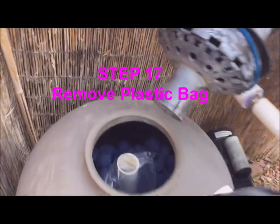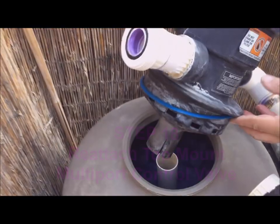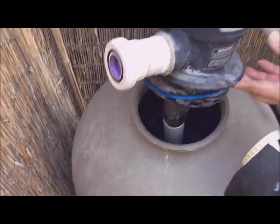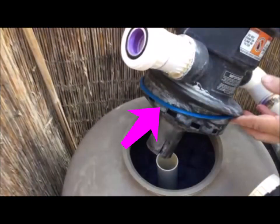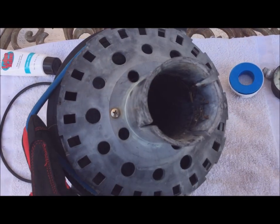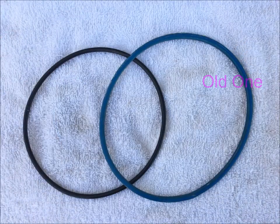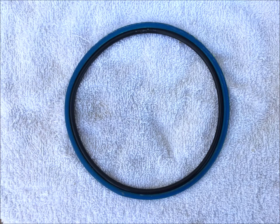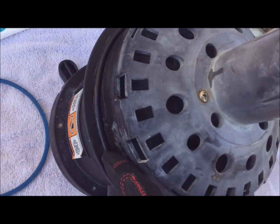Let's replace the top multi-port valve. Remove the plastic bag and make sure that the O-ring for the tank is on and lubricated. Connect the opening in the valve to the top of the pipe. If your tank's O-ring looks stretched out, it's time to get a new one — the new one is on the left and the old one's on the right, that's how stretched out it was. The new one didn't look anything like the old one but it still worked. This is how an O-ring is supposed to look and sound.